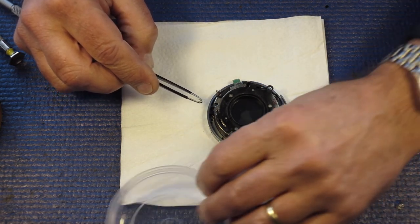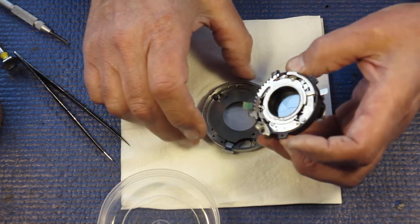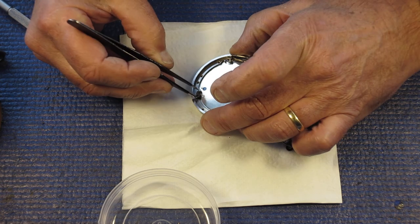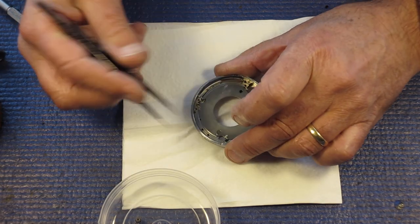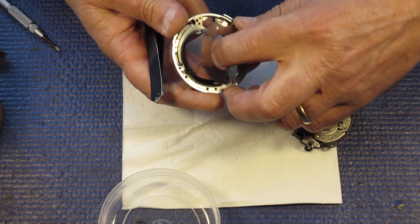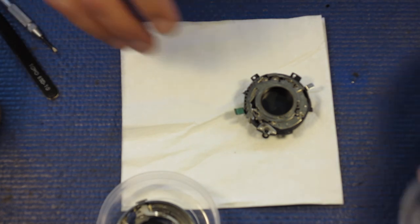I'll pop these screws and put the parts as they come off into a container. That comes off the front of the case. There's a little idler pinion. That couples up the motion for the component which opens the diaphragm in your lens. That little ball is the detent for the shutter speeds. And that's just the front cover plate — nothing else needs to come off there. Consider those the outer shutter components.